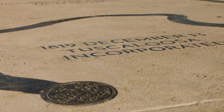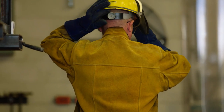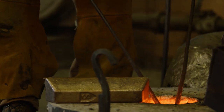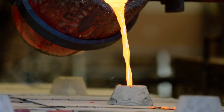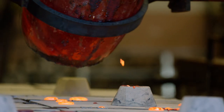The process we're using for this piece is resin bonded sand molds, wherein basically you have a pattern, then you mix up a bunch of silica sand with resin, pack it all around your pattern, remove the pattern leaving a void, close your mold back up, pour the metal into that void, and bust off that sand mold — so it's a one-time thing. Then you retrieve your metal, hopefully fully cast, and clean up all that stuff and put it all together.